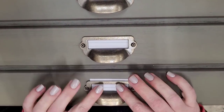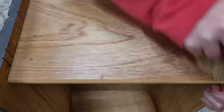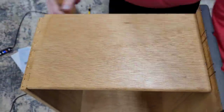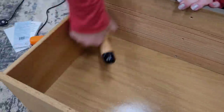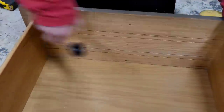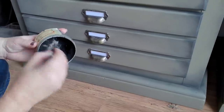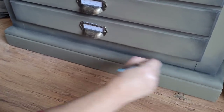Just be aware the screws aren't the greatest quality. I cut up some lined 3x5 note cards and placed that paper inside all of the pulls. With all my drawers out to get their hardware, I went ahead and added Big Mama's Butter — I always condition my wood drawer boxes so the wood is nice and refreshed when it goes home. This step is part of maintaining vintage furniture; it's easy to forget that wood dries out and the insides need to be maintained as well.